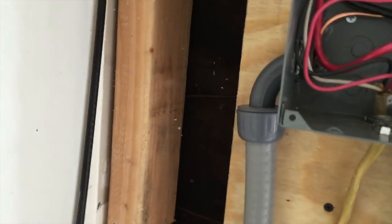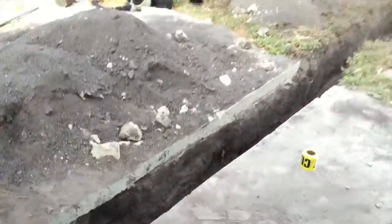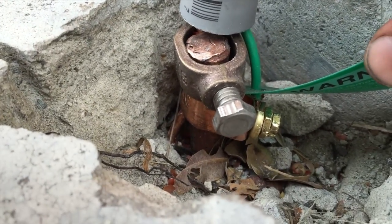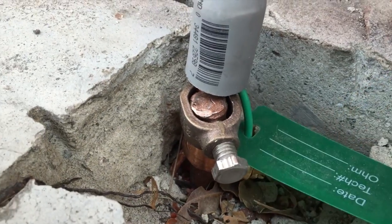One thing I'd recommend: if you're pulling 6-gauge wire, get as thick a conduit as possible. 1.5-inch was okay, but once you're going a significant distance — I went 60 feet or more — it becomes very difficult to pull the wire. It also makes it hard to connect the conduit sections, glue them, and put them back together. That was one of the harder parts of the job.